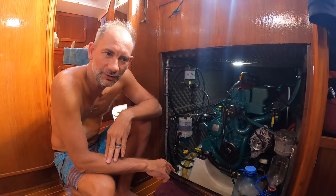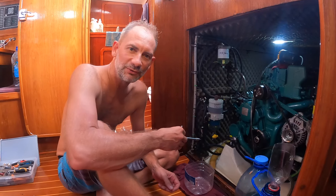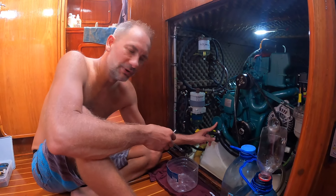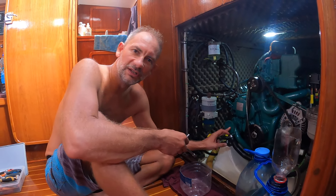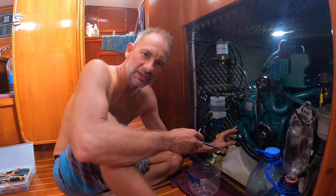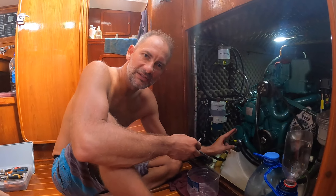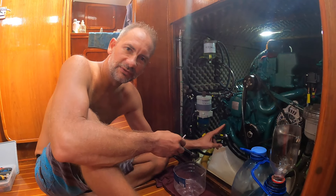After that I'll also extract the sail drive oil, which is about three liters. While I wait for the oil extraction pump to cool down, I'm going to start removing the sea water or raw water impeller used for the cooling water. We've had this one in for about a year but the water is quite dirty here in Indonesia. Before you do this you just need to close your sea water inlet sea cocks so that you don't flood the boat, and make sure you try to catch the sea water below so it doesn't make too big a mess, because sea water is pretty corrosive. You can always just rinse it off with fresh water after.